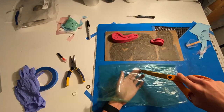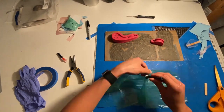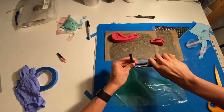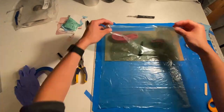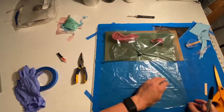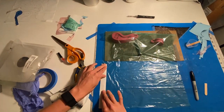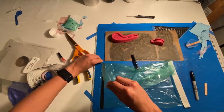Here, I'm inserting the vacuum port so that we can pull all the air out of the bag to form the part. The black tape seals the side of the bag to make it airtight. This stuff is incredibly sticky, so my advice is to measure twice and go slow.